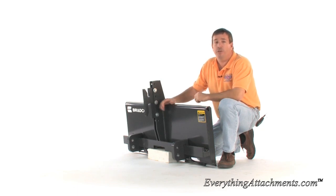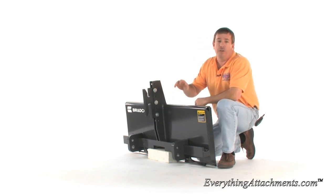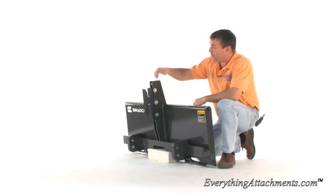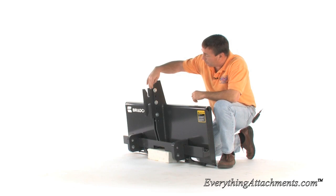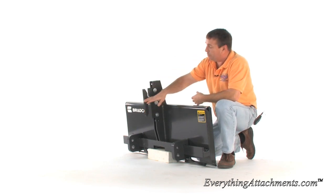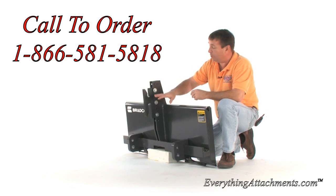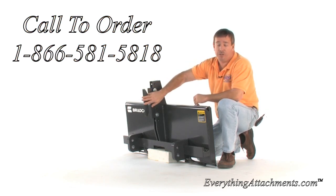It's not suited for everything, but there are a lot of attachments that will cross over well. The one thing you need to remember on the type of attachment you're going to be using — it will need to be something that would allow you to use a quick attach on it, because from where your top link goes to the bottom of this is going to need a clear area below it. So some implements would work fine for the top link and some wouldn't, so just keep that in mind on your attachment, whether it's quick attach accessible or not.